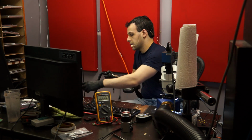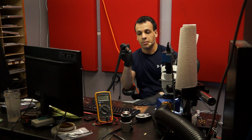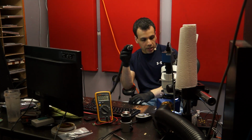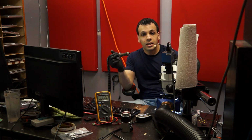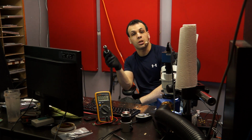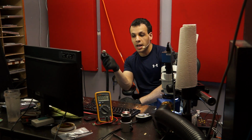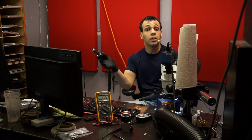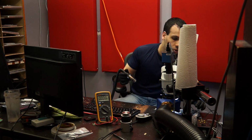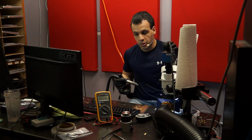Heating is an excellent diagnostic tool, right? When you use it with precision. So, for example, I want to see, is it that capacitor? I can heat it, and if I get a response out of it, then I know that that component is bad and faulty. But heating an entire board, you're not fixing anything, but it's also really not a diagnostic tool. The reason it's not a diagnostic tool is because there's no precision. How do you know what part of the board was actually bad? You have no way of knowing what part of the board is bad because you heated the entire board. So essentially, heating is one of the best ways to help diagnose specific faults in specific areas. It's a really good tool in your arsenal, but it's only good if you use it the right way.